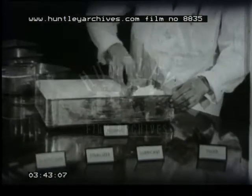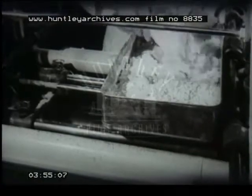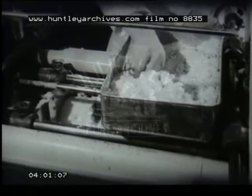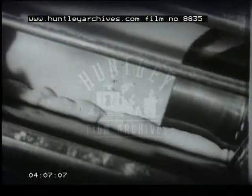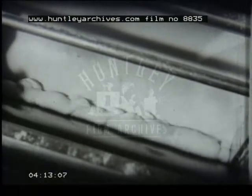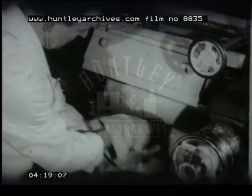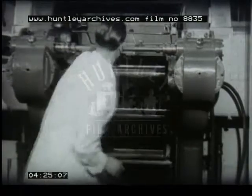These materials are all added to the polymer and roughly mixed by hand. Thorough mixing is carried out on a two-roll mill. One of these rollers is rotating faster than the other, and both are heated to about 160 degrees centigrade. After ten minutes or so, the polymer swells in the plasticiser, forming a gel. In this stage it can be removed from the mill and chopped up for injection moulding machines, extrusion, etc.